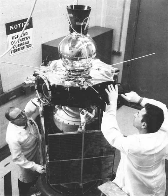The instrument had three ranges covering ±20, 60, and 200 nT full scale for each vector component. The digitization accuracy for each range was 1% of the entire range covered. The magnetic field vector was measured instantaneously, and the instrument range was changed after each measurement. A period of 2.05 seconds elapsed between adjacent measurements and a period of 6.14 s elapsed between measurements using the same range. The instrument performance was normal.